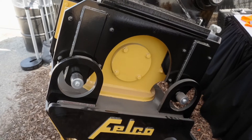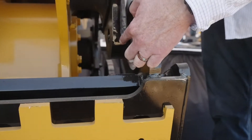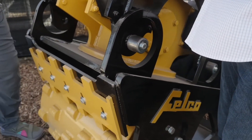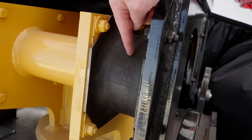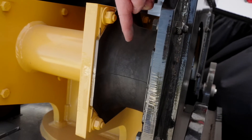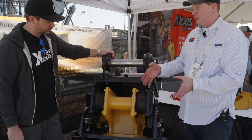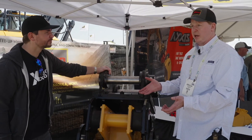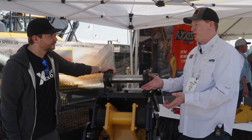Excellent question. We do two things here with the combination of our mounting beam and the travel limiter. That allows you to go just under half the diameter of these isolator pads, which is what the manufacturers recommend. So you can push that down, it'll stretch, but you won't stretch it too far and prematurely wear those isolator pads. Those are $250 a piece or more — so if you tear those up, you're talking about $1,000 to repair them plus downtime on your equipment.